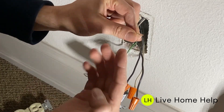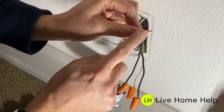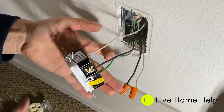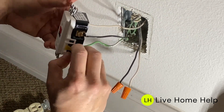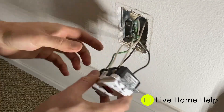If the previous installer cut the copper short or it's about to break, strip a fresh section of wire, insert the wire, and tighten the screw securely. Next, connect the hot wire to the brass screw. Perform a pull test to ensure it's secure. Remove the bottom sticker for the load side, connect the wires, tighten the screws securely, and do another pull test to confirm everything is solid.